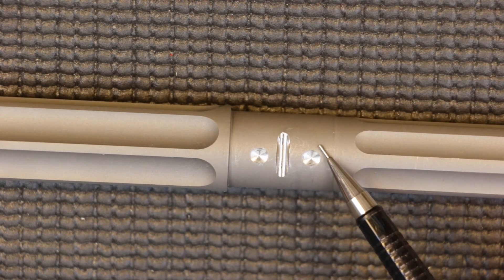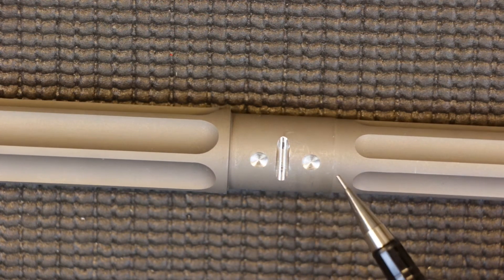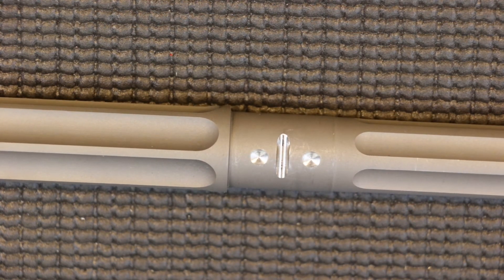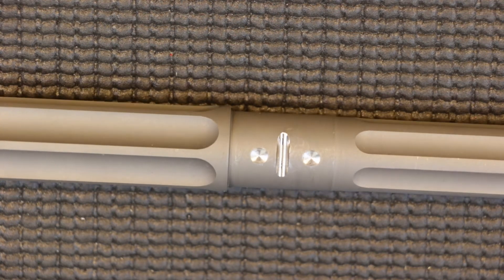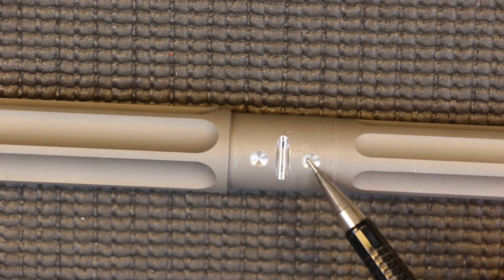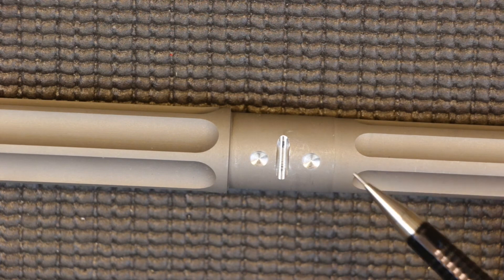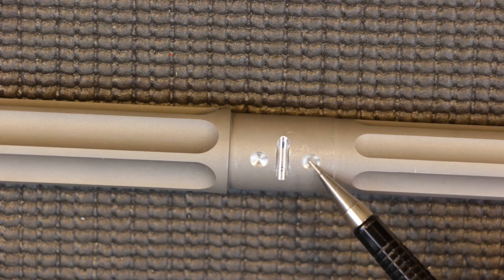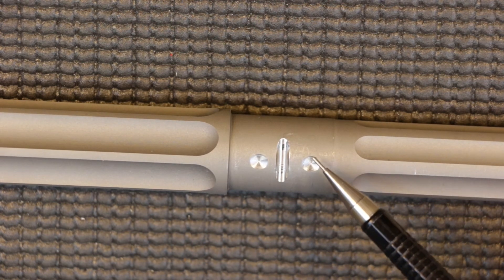As I was drilling the two dimples, both the drill and my hand were blocking the angle for a good view, so fast forward to this point — both dimples are now completed. A couple of tips on the process: first, set your drill on a low speed setting so you don't over-drill and remove too much material. In terms of depth, you're only trying to remove about 1/32 of an inch from the barrel surface. Also, this is a 416R stainless barrel, but if you're using a 4140 or 4150 CMV barrel, be sure to treat the raw steel of both the dimples and potentially the slot location if you have a pinned gas block, to prevent corrosion.